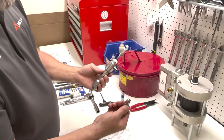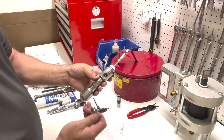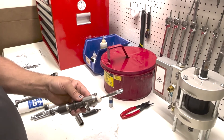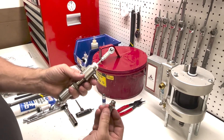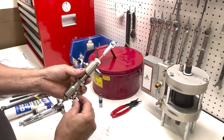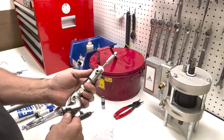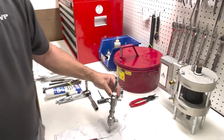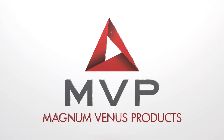You have your outlet fitting — make sure to change this o-ring. All these o-rings are in the kit except for the one in the bottom. Screw it down and snug it down. Your inlet is the same thing — change the o-ring, snug it down. And that concludes the catalyst pump rebuild.